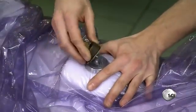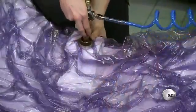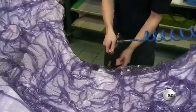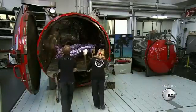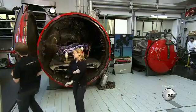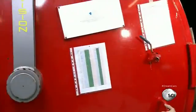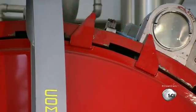They install a vacuum fitting valve to create a sealed joint between the bag and the vacuum tubing. A pump sucks the air out of the bag to create a vacuum, which protects the carbon fiber during the cooking process. They place the mold in an autoclave oven, an industrial pressure vessel used to process composite materials such as carbon fiber. It works as a giant pressure cooker, submitting the material to high pressure and intense heat. The door shuts hermetically before the pressure and heat start building up to shape the carbon fiber part.